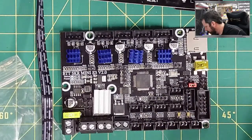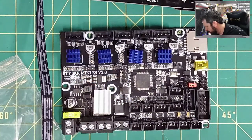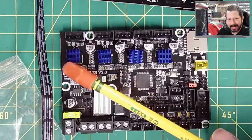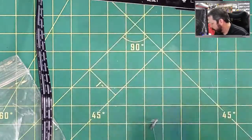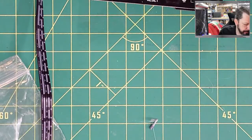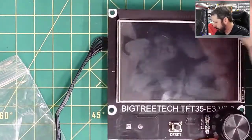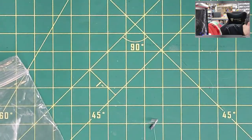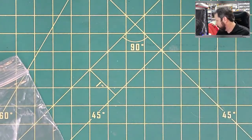I think, though, that this driver has failed also, and that was probably something I did, but I don't know. Anyway, we took this board out. We went back with the 1.1.4 board, the 8-bit board, which also meant we took out the touchscreen, because we need to be able to plug in the touchscreen, and that board doesn't have a way to do that. So we're back to the 8-bit days on our printer.